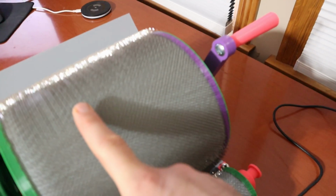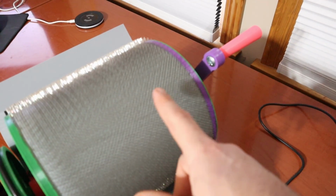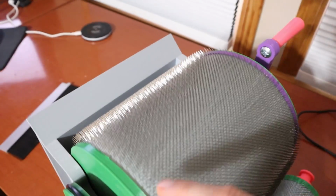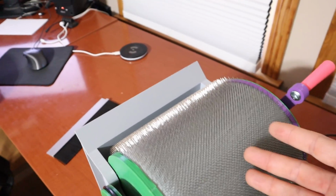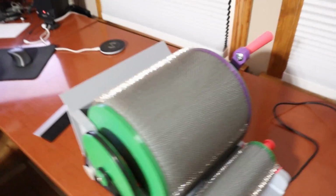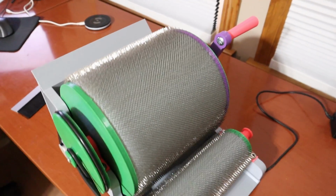So the next question I'm asking is about the actual cloth here. This is a medium grade cloth. It's 72 teeth per inch, so 72 of these little wires on every inch, and that's considered a medium cloth. I could get coarser than that made, and finer, and extra fine. But each one of those cloths is a lot of tooling for me to set up, so I really want to figure out hopefully just 2 cloths that'll work for most people.